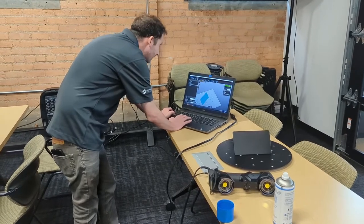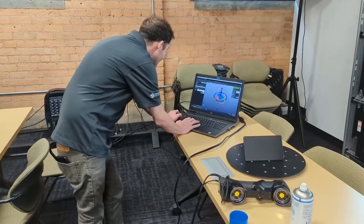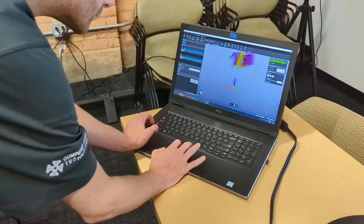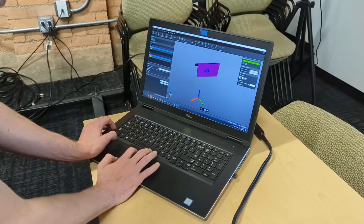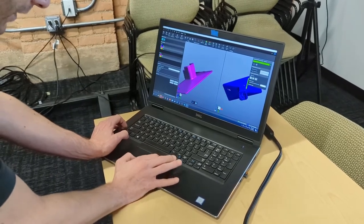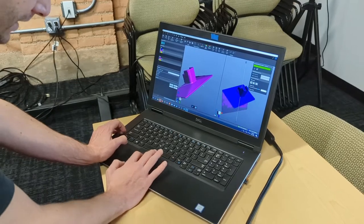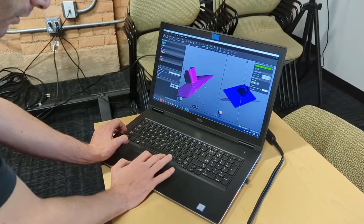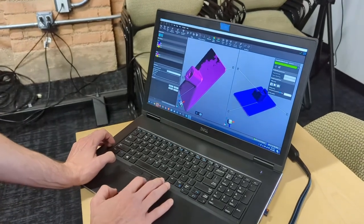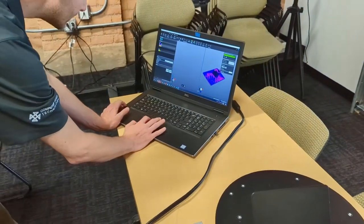So now you're going to bring in all three scans? I'm going to do some alignment to get them close to one another. My job is to get them close so that I can select common areas. They don't have to be exact — because of the uniqueness of this geometry, once we get it close, all I have to do is say 'best fit' and the software will evaluate the geometry and line the two of them up.